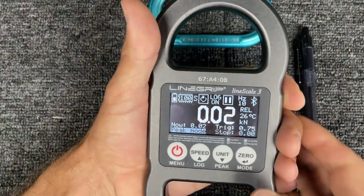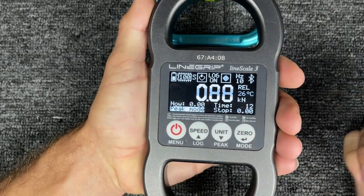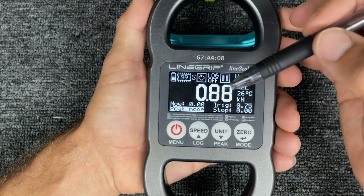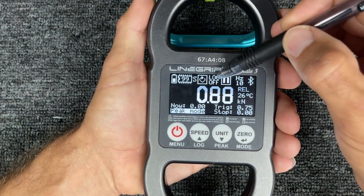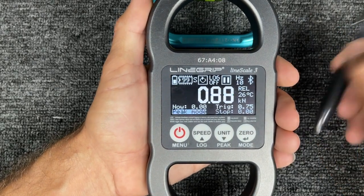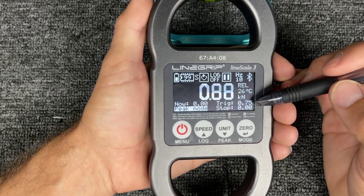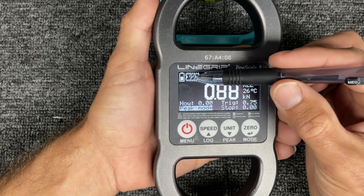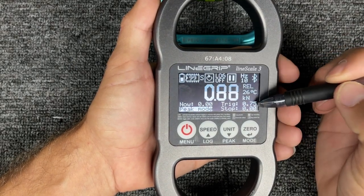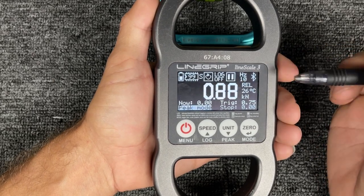What happens in single mode: if I trigger this, log is on, it's going to trigger at 10 Hz. It's recording and you can see the time counting down. After it's done recording, it saves and turns my log off — which is why it's in single mode. If I accidentally keep it over the trigger threshold while rope swinging and the person is one and a half kilonewtons, and it just keeps triggering — you're going to fill this up and have only one useful log out of 50. But you also don't want to trigger it right before going because you set it low and then it records once and you miss your actual recording.